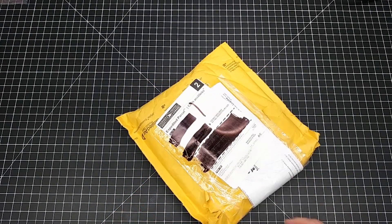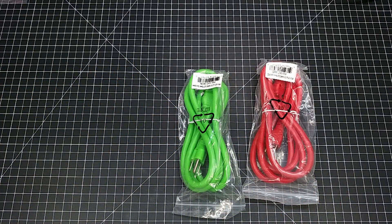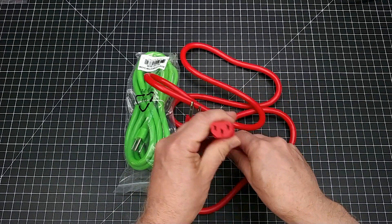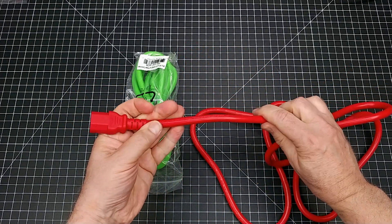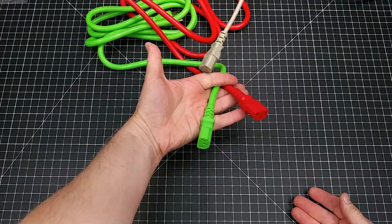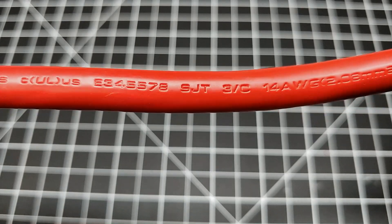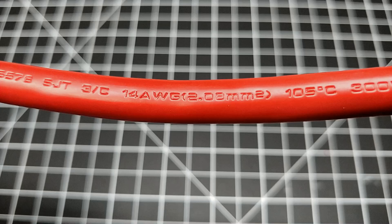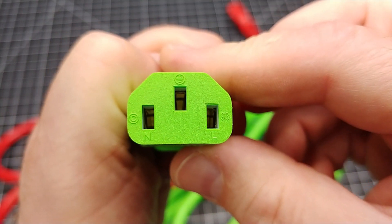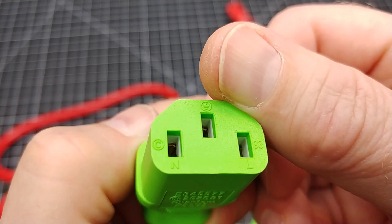Not from China — pretty colored power cables. I have one of those long workbench power bars at the back of my bench, mostly filled up with classic beige or gray power cables. I wanted some high-quality power cables of different colors so I could easily differentiate what was plugged into what and, more importantly, where the other end was plugged into my bench power bar. The quality of these cables is excellent — they are very thick, 14 AWG, rated for 300 volts, and CSA certified. The embossed stamp shows this is a product from Phantom Cables, and even includes the CSA certification logo.